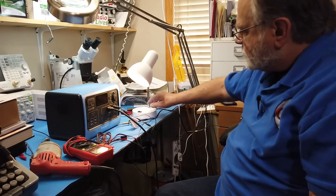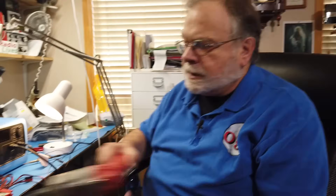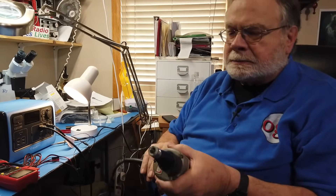The fan noise is quieter than the other unit. It is outputting power to the lamp without any flicker. Looking at the oscilloscope, the voltage is very constant at 113 volts RMS — about 10 volts lower than a wall socket, but still perfectly acceptable and will run any AC load, including an inductive load. Not all solar power converters can run inductive loads. To test: plug a drill in and bring it all the way up to speed, which you'd normally do with a screw shooter anyway.